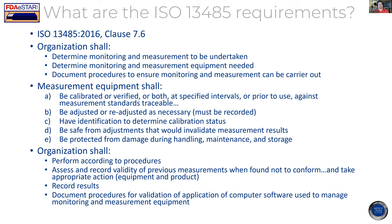You also have to assess the validity of your previous measurements. If you took a measurement yesterday and found out today that the gauge was out of calibration, you have to go back and figure out whether those results were still valid. You might have to re-measure, or pull product from the market — or you might determine that the gauge was only out by a thousandth of an inch, well within your tolerance, so the product is still conforming and you only need to worry about the gauge. That assessment must be documented. You also have to record all the results of your calibration, using a form, a log, or a computer system.